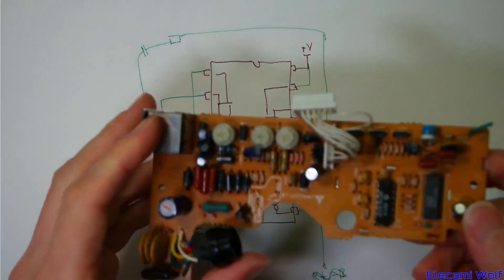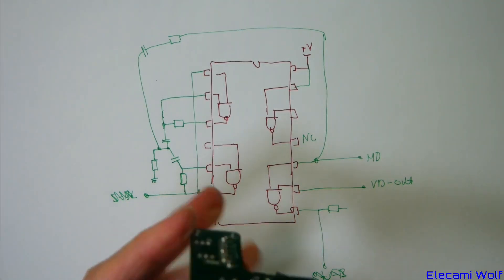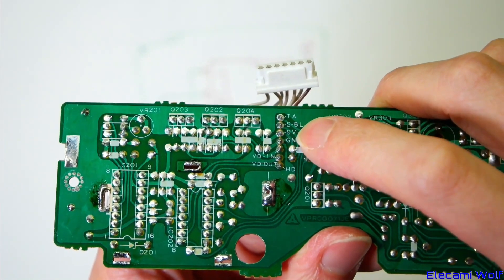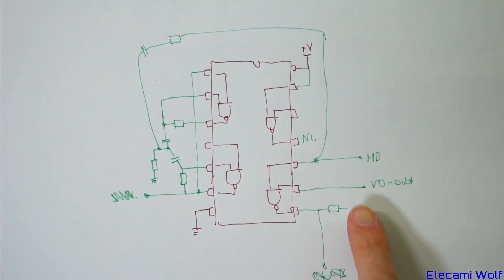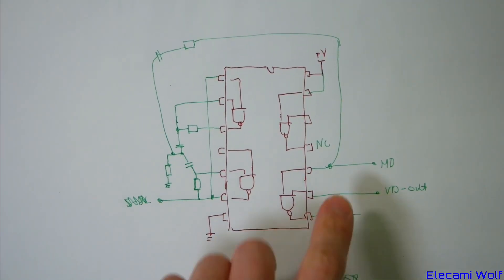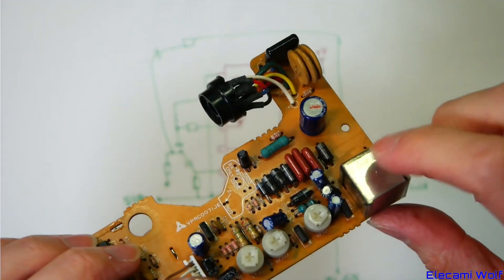I had a bit of a go at tracing out the circuit involving those NAND gates. I'm not really sure what's going on there without spending a lot longer on it. There's some labeling there which gives some hints - I assume that's something to do with blanking, and there's vertical drive in and out, horizontal drive, and they get vertical drive out. But that goes to an input there that gets NANDed with the horizontal drive to make that SLBL signal. Horizontal drive also goes over here and disappears into the circuit - it must be used for driving that little flyback I guess.